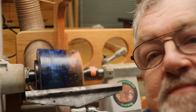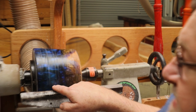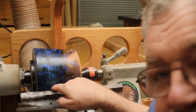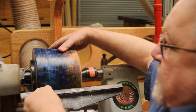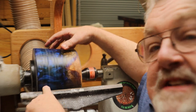The issue with the negative rake tip is that sometimes you can't get your tip low enough. Even with the negative rake, I find myself holding it on a downward angle. What I'm trying to do is cut the resin right below the center line, where the object is scraping on it instead of cutting straight into it — scraping on it. That's the point I want to illustrate here.